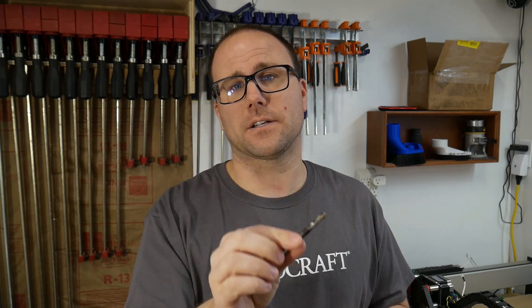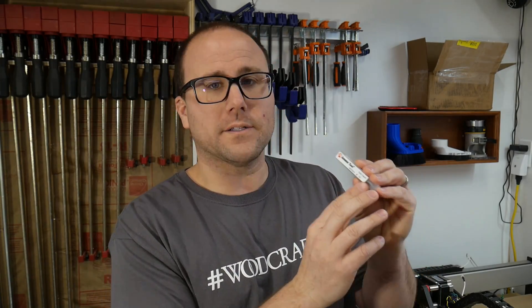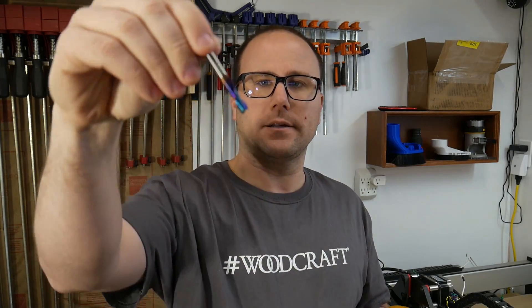When it wears out and it's not sharp and it starts not cutting well, go ahead and replace that bit. So I'm switching from the 201 that came with the Carbide 3D Shapeoko, and I'm using an Amana tool number 46102-K — it's a spectra-coated bit. It's brand new, upcut, and that's what I'll be using today.